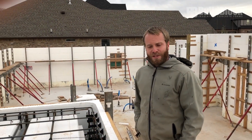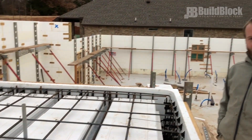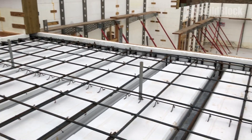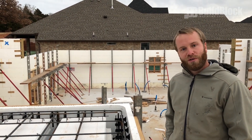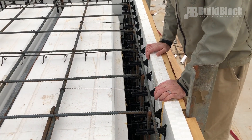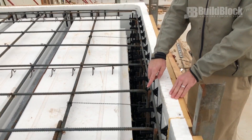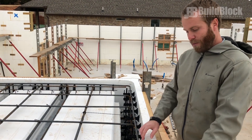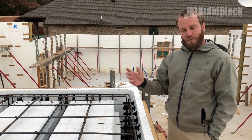Another important step is making sure that we've got all of our rebar secured. Here we have a safe room that's going to be installed and so I have a decking system. I want to come up here and make sure that I've got all my rebar tied in and secured. I'm also going to be checking to make sure that I have verticals in all my walls, looking down my walls to see where I have those cold joints and making sure that I have rebar at every single one of those spots. I've also ensured that I've tried to tie this rebar to the top bar in as many places as I can so that I'm not going to have those bars floating around.